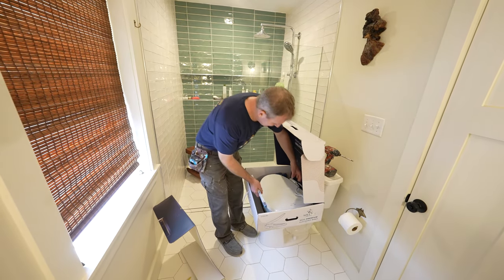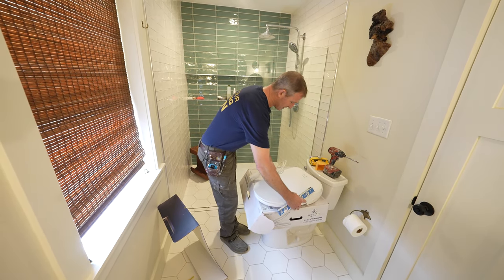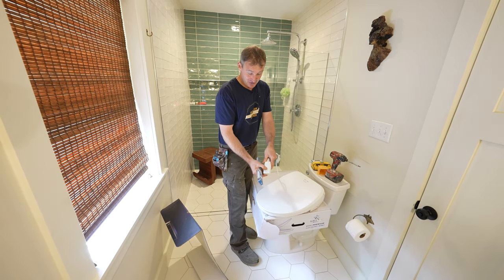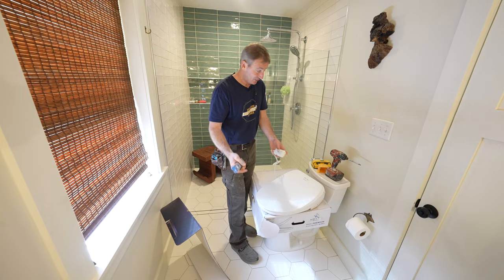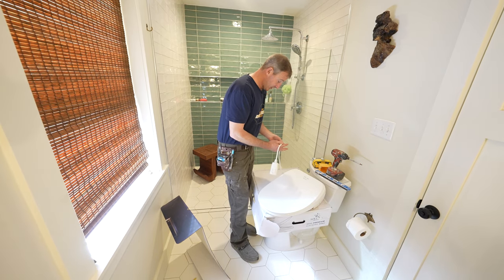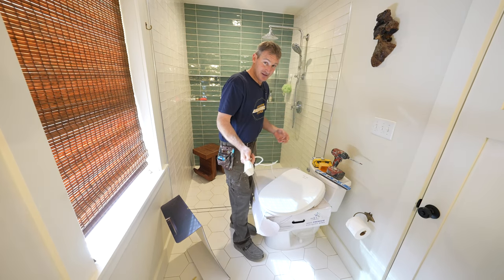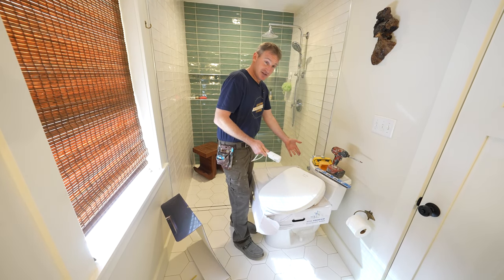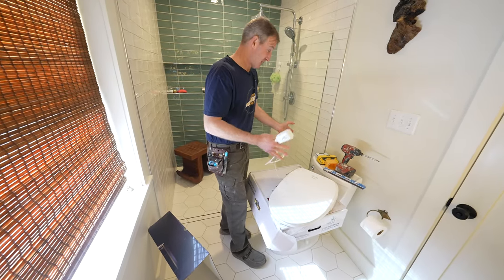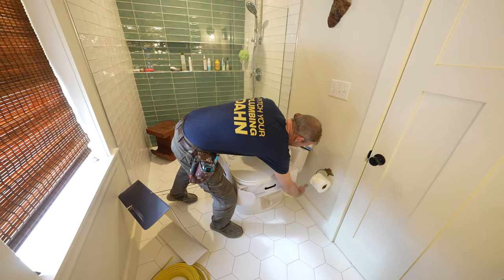Keep in mind that the outlet is GFI protected as it is right now. The GFI we're connecting to is already GFI protected, but it does have its own GFI adaptation — so if you just wanted to put a regular outlet in, this is going to protect it. You can see how long this cord is — about three feet — so you have plenty of ability to plug this in behind the toilet. In the other presentation we put it on the left-hand side next to the water supply, but with the shower door and the way this is configured, it's just too tight. So we're going to put it on this side and keep it down below so that it's somewhat hidden, and we'll pay attention to where our studs are before we commit to anything. We basically have a stud right here and not another one until behind the toilet, so anywhere in here we're going to be capable of running a wire through.